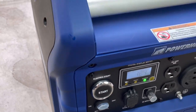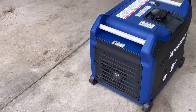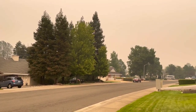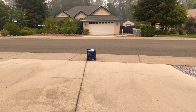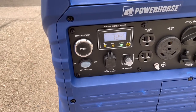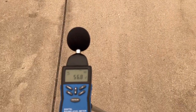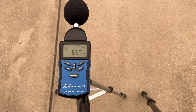We're going to put this in economy mode, then go outside and do some testing — some sound checks and a load test to show what it sounds like under load. There's some smoke and ash out here because I have fires burning 360 degrees around me, which makes filming conditions a little difficult. The generator is at 23 feet away, which is how I've been doing my testing — very consistent. We're running right around 59.5 decibels, maybe almost 60 with eco off. Then we'll turn eco on — look how much quieter it is. I want to show another method of making your generator quieter in just a minute. For the load test we're going to use a heat gun — about 750 watts on low and about 1500 watts on high.